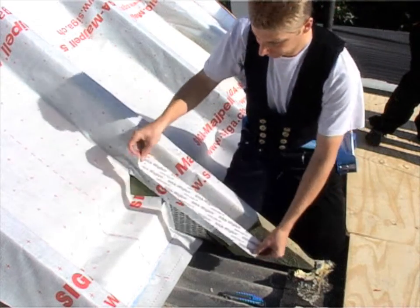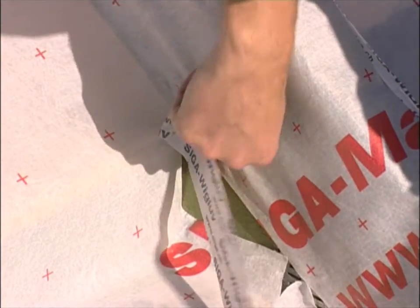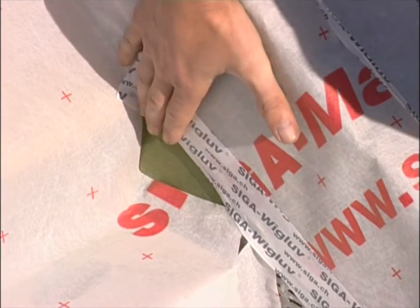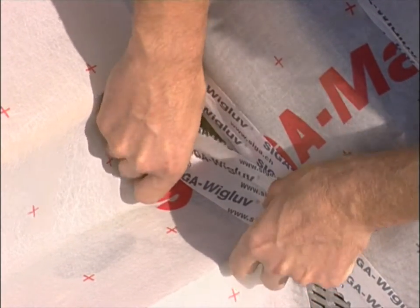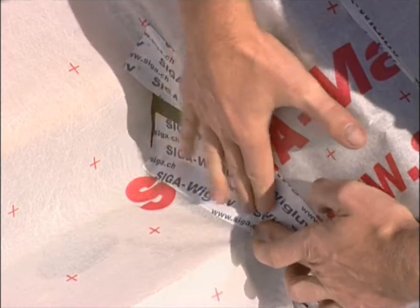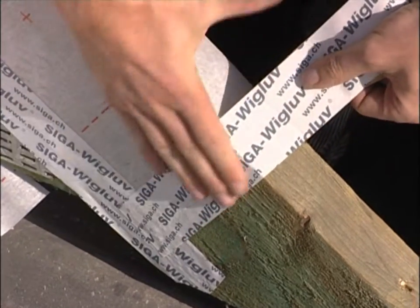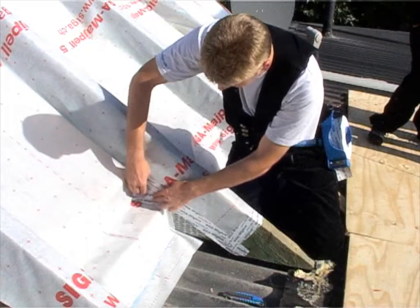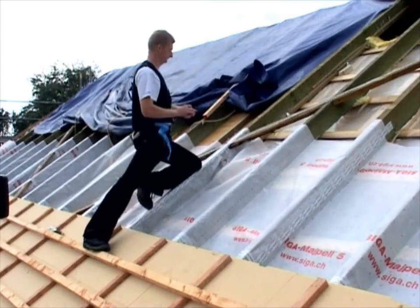V-Glue can be attached permanently and securely even in tricky spots, which are very common in roof renovation. Cut V-Glue to length, stick V-Glue halfway to the penetration and then on the sheeting, pressing on tightly. Arrange the following pieces to overlap. The vapor control layer is stuck down using V-Glue so that the roof can function as an emergency roof and can be subjected to rain for a short period during the building phase.